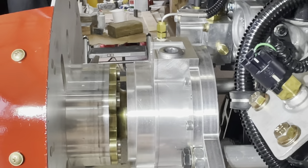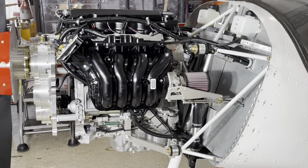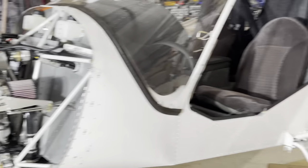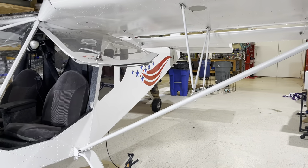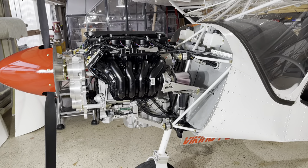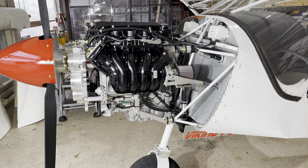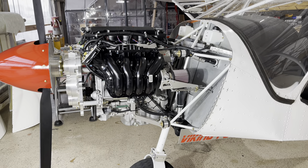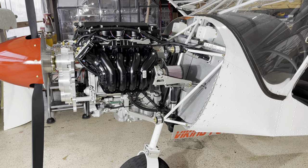It can also be 90 degrees to that in front of the gearbox if you'd like. Once the engine is hanging on your airplane, be sure to support the tail of the airplane properly. The last thing you want is for the tail to fall on the ground and damage your airplane because you don't have the weight of an engine up front. Anytime you remove the engine temporarily or want to take a bolt out to put another washer in, always think about that — the airplane can fall on its tail if the engine weight is not up front.